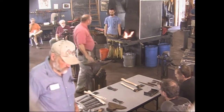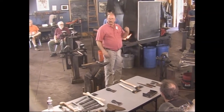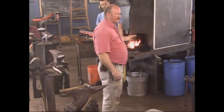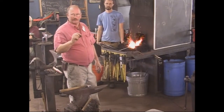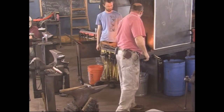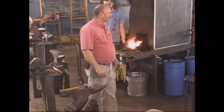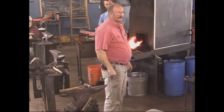This is sort of a take on Paul's little forging contest last night — I had to start with a round bar but I need a little wedge-shaped piece. We don't have any rectangular tool steel, so I've got to reforge this. I've already reforged it to a rectangle to save time, and then we're going to forge it into a taper, sort of like Peter did for his lock sides. Essentially you're making a scarf that's going to blend inside the axe. If you just stuff a square piece of steel in there, you're going to end up with a little step and you're never going to hide it or get rid of it.